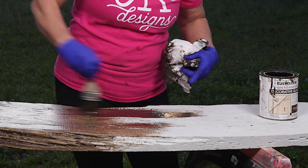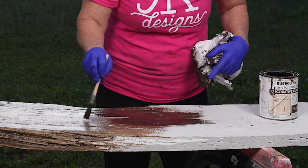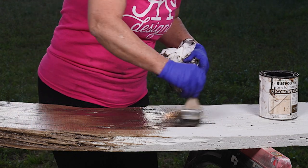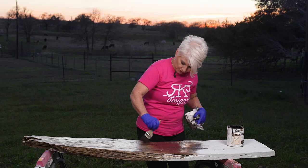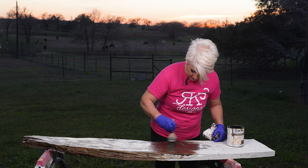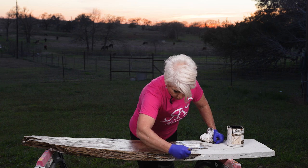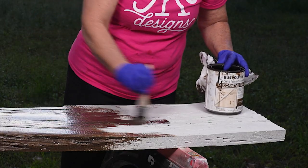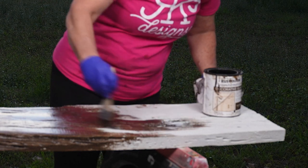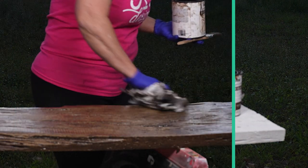You can do this technique — and you've seen me do it — where I use the texture medium, run my decorative roller through it, and create that texture. This is the same sort of technique I use on those finishes, and I've done quite a few of those on countertops. You can also come in here and create some additional texture, once you've wiped that glaze off, by just stippling your rag or paper towel.